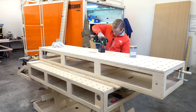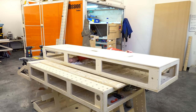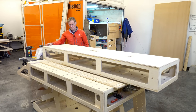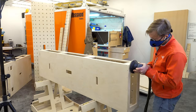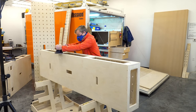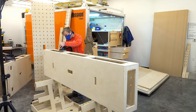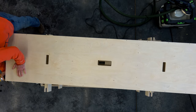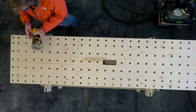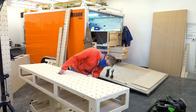Then it's just gluing up and doing the screws, working my way around. I jump around rather than starting at one point to make sure all the corners are good, then pull the sides out in the middle. Once one side is indexed perfectly it makes the other side indexed perfectly — that all depends on all the parts being cut to the exact same length. The first side is completely assembled. I'll clean up quickly to stay ahead of dry glue. Success — both sides are completely assembled and ready.